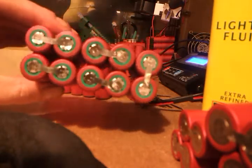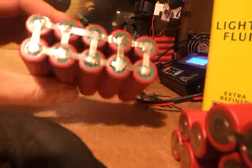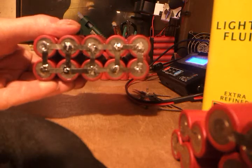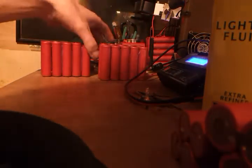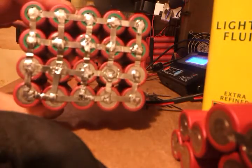So you've gone to this point: you've taken your patch, you've built it with your glue gun to look like this — or in single cells they wouldn't have had the tabs — and then you've paralleled them up and they'll look like this. Then you series them up and it looks like this.